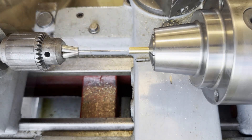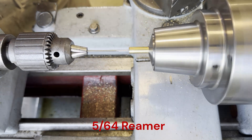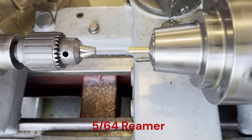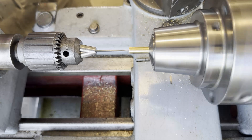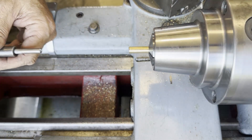It's a small drill bit so be careful — don't put too much pressure on it or it'll wander off center. Then go in with a reamer and ream that hole. You definitely want the bore of the barrel to be nice and burr-free, so the reamer helps with that process so that your ball bearing will seat properly.